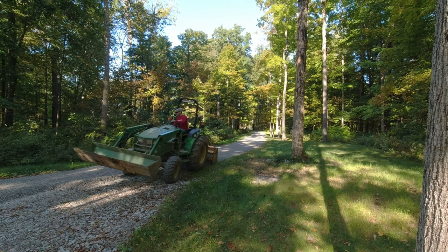One other thing I wanted to mention: obviously if you're going to be doing this kind of work you're going to need a piece of equipment. Now if you do it commercially, a skid steer is probably the way to go. If you own some acreage and this is for your homestead, I would go with a compact tractor — there's just so many uses for a piece of equipment like this around a large property. Also, if you can get a top and tilt kit on your tractor on the rear to be able to angle the box blade, it makes life so much easier. You don't even need something this big — this is a John Deere 4 series, 52 horsepower, and it's a big box blade. You can get it done with something quite a bit smaller; it just takes more time and fuel, but that's the enjoyable part.